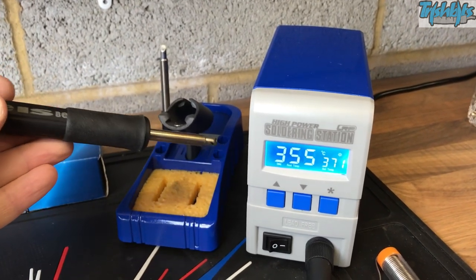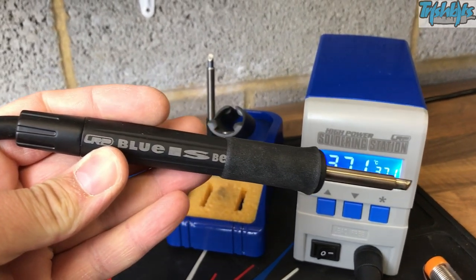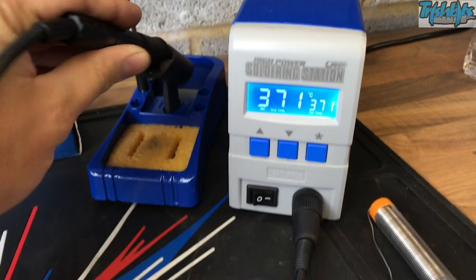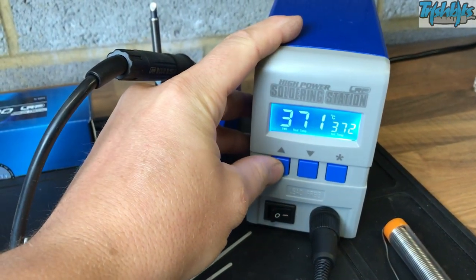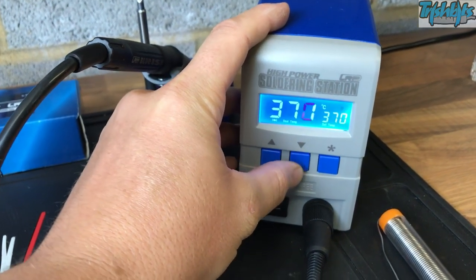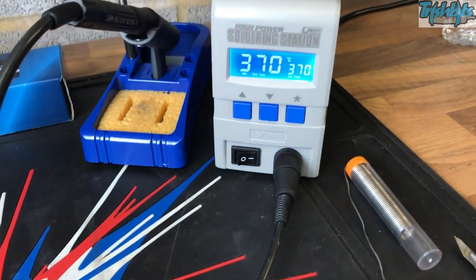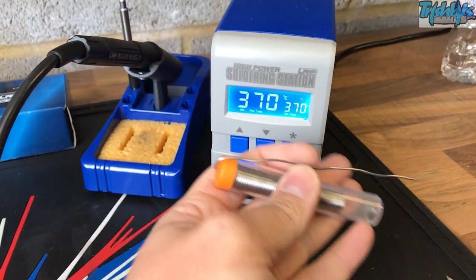It's actually an excellent soldering iron but most soldering irons out there will do this job. If you're in a normal temperature room, not outside in the wind or anything like that, you should be able to do it. But you do need a soldering iron that's got a reasonable amount of power. Be aware of some of the real budget ones for finer gauges of wire. This soldering iron can hold a lot of heat, but you can get that with some 80 watt soldering irons with the big spade ends on it.